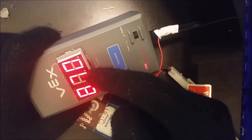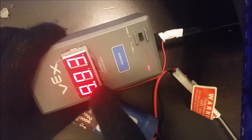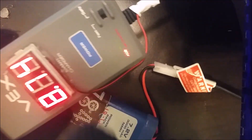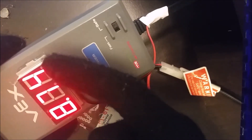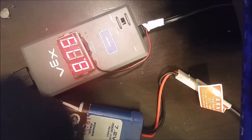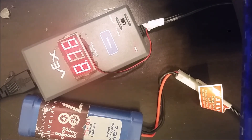While charging, it will show a 0.2 volt higher reading than the actual voltage — so right now it's actually 8.5 volts instead of 8.7. If you're charging on fast, it'll show a 0.4 volt increase. But when the light turns green, meaning it's fully charged, it will stop applying that extra voltage and give you an accurate reading. Good luck if you try this — don't get hurt, and thank you for watching!